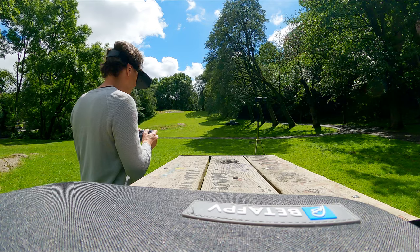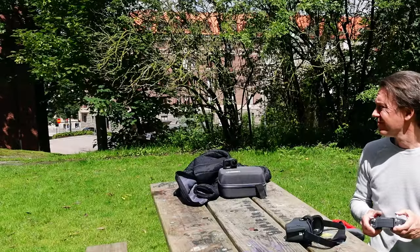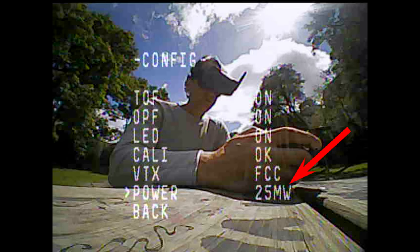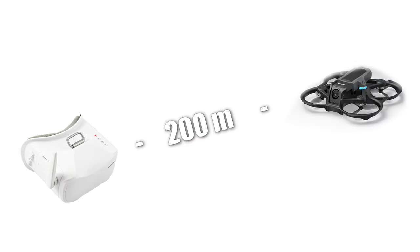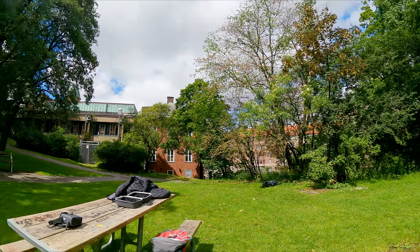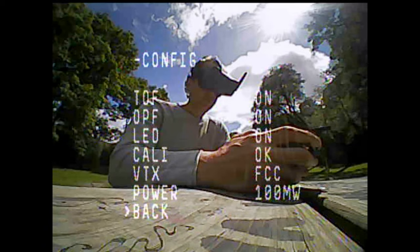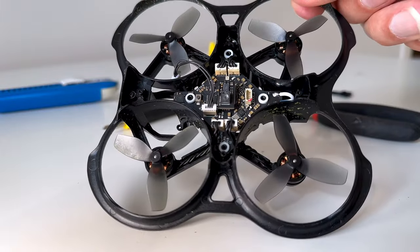The second flight added even more problems. There is a setting that adds more power to the transmitter — it's set to 25mW by default, with 350mW as the highest setting, meaning a stronger signal and better range. This didn't work at all with my drone. After taking off, the signal cuts off completely after only 10–20 meters. After fiddling with the settings to add the power levels, I never got a good image in the goggles. With more power it was actually a worse image. After lots of research and reaching out to Beta FPV, I finally brought out my screwdriver to perform some surgery.